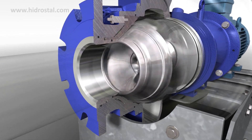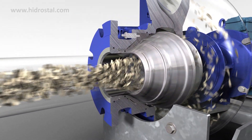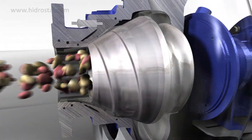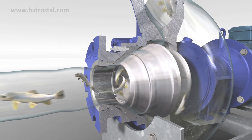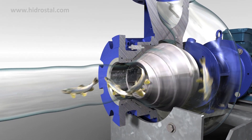An enclosed V-type impeller is available for heavy-duty abrasive industrial applications such as pumping wood chips. The smooth transitional path through the pump also makes it suitable for vegetables and soft fruits, as well as applications that require a high concentration of solids to liquids such as live fish and raw produce.